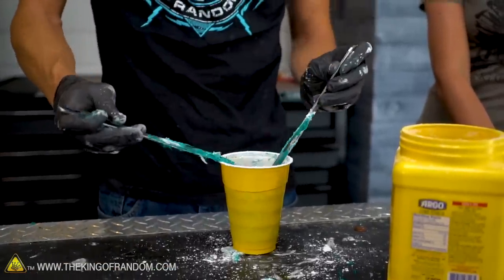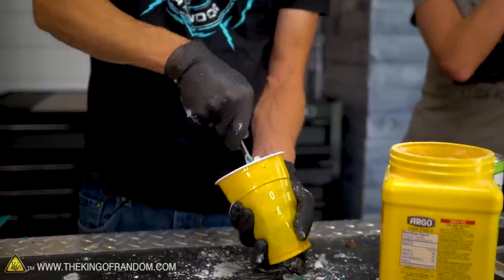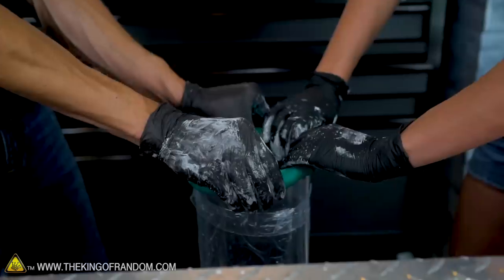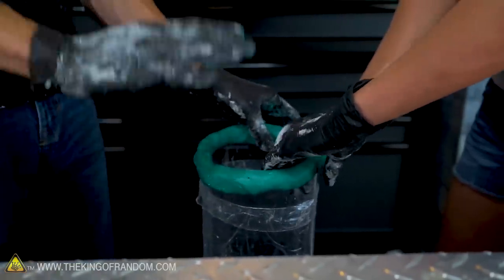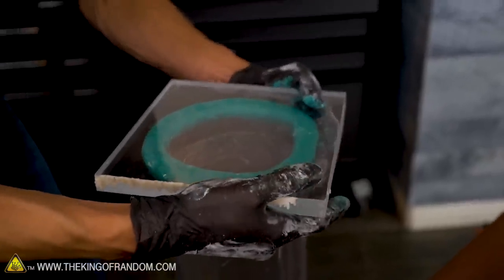You're gonna get to a point where it stops sticking as much. We do want a nice smooth mix — I try to do that with the knife but often end up just having to use my hands anyway, which is why I wear gloves because it's a very messy process. I like to at least get it somewhat stirred in before I move to hands, otherwise it just sticks immediately and massively and you can't even mix it up anymore — it's basically like if you're gonna be very rough with some bread dough. Lightly squeeze it on everywhere — we want plenty on top of the ridge because when we put the lid on it's gonna squish it, and we don't want to cut through the proto putty. Press it on and make sure it smashes down flat, in contact with the acrylic, bringing it up a little bit on the sides to give a bigger surface area.